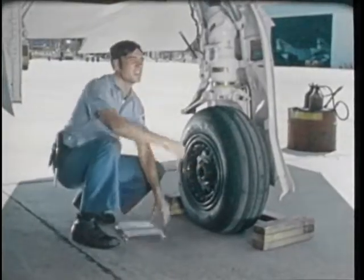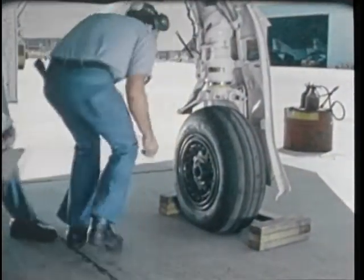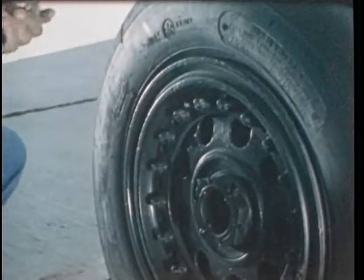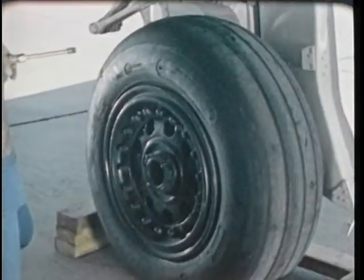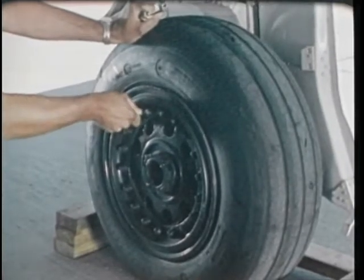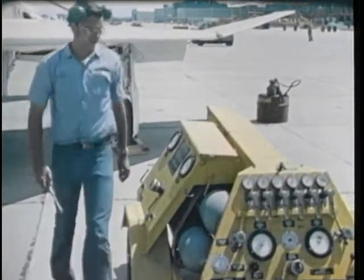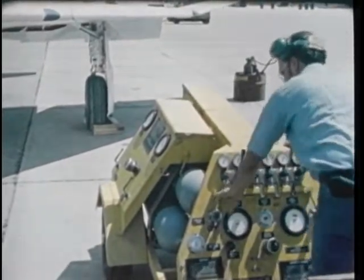As the plane captain, it is your responsibility to assure proper inflation on daily inspections. Check pressure when the tires are at ambient temperature. Remember, the required pressure will vary for land-based aircraft in accordance with gross weight. Carrier-based aircraft operate at fixed pressures. When checking the pressure, inspect the condition and position of the valve stem. If you suspect a leaky valve, tighten and check the valve core. If a tire shows a repeated loss exceeding 5% of the correct operating pressure, it must be replaced.